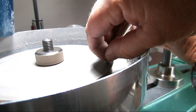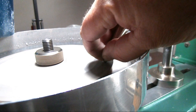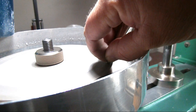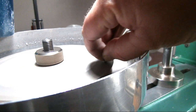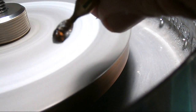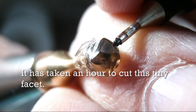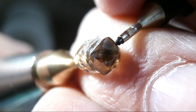I've been cutting for another 20 minutes on the 240 grit lap, so all up I've been going at it for an hour, making a little bit more headway. On the 240 grit lap there's clearly a lot more grinding going on because I can actually feel the diamond gripping onto the surface of the lap. I'm pushing fairly hard but not hard enough for the gem to come off the dop. The odd thing is you can hear it grinding but there's no real sense of cutting down to depth — it just shows how hard this gem is. Literally, it could take months to cut a gem this size on the faceting machine that I have.